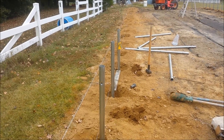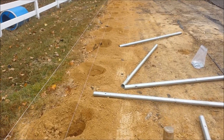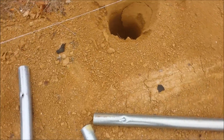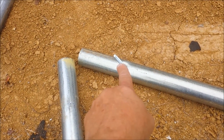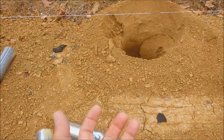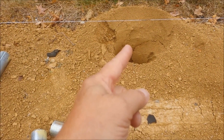Each hole is approximately 28 to 30 inches deep and the posts are driven down into the dirt pretty good ways — they have to be 32 inches down. One of the things this greenhouse has that the others didn't: these are carriage bolts. They go through the bottom hole and each post has yellow paint on the bottom. This carriage bolt goes through the bottom hole and you bend it — I just take the sledgehammer and bend it a little bit — because when it goes down in the hole, concrete sits on top of the bolt. The concrete, I found out, is not mainly for structure against snow or anything like that. It's mainly for uplift. If you get a lot of high winds, you don't want that pole pulling out — the concrete will hold it in.